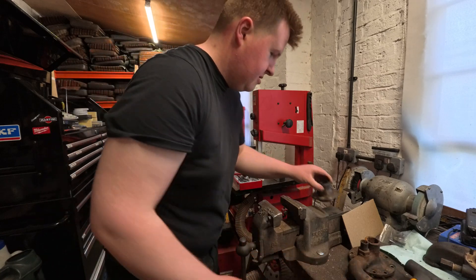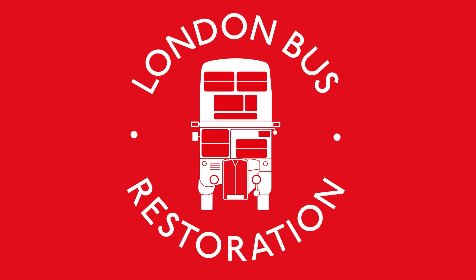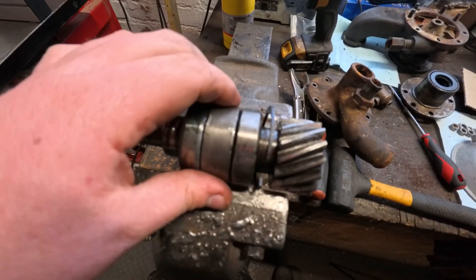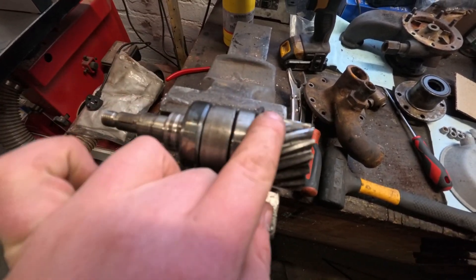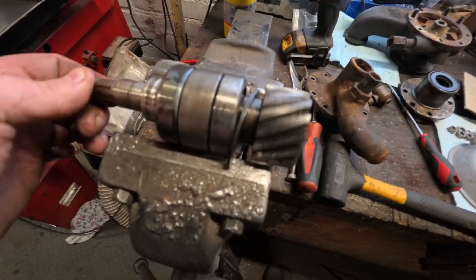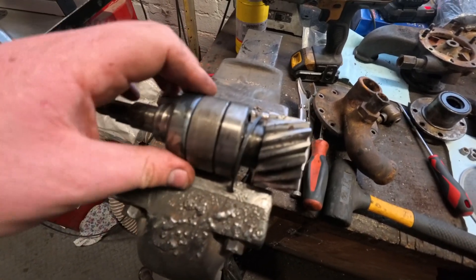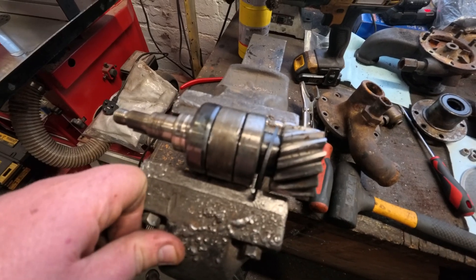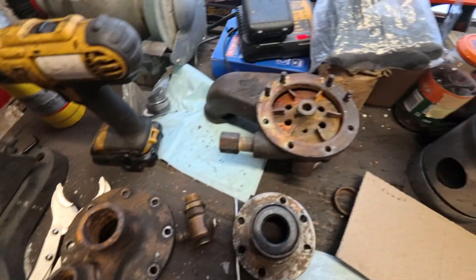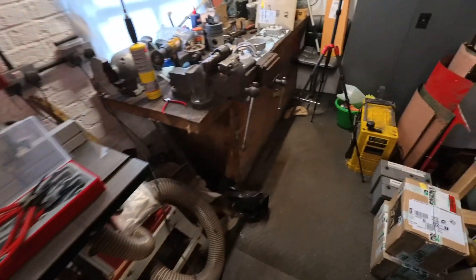That's the centre out of the housing. Now we can look at the bearings to get those apart. The centre shaft is now out of the body of the pump. I need to press this gear off so that I can get the bearings off and order the new bearings. You can't see it here but the shaft is spinning in the bearings and the bearings aren't moving - I need to have a look at that when I take it apart. They're all quite badly worn and need replacing.